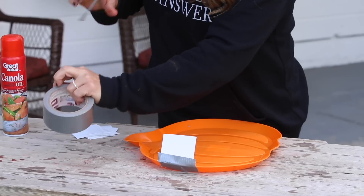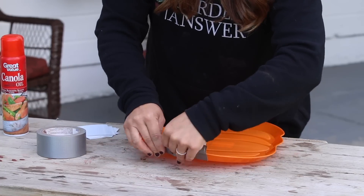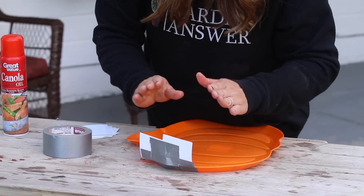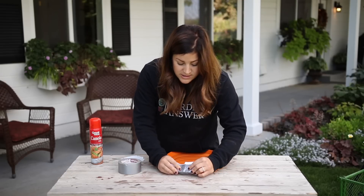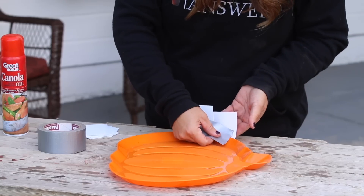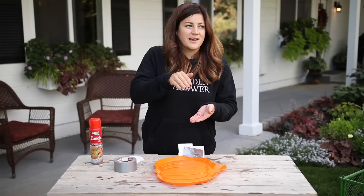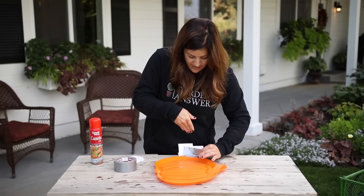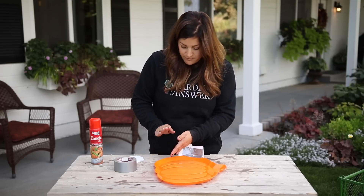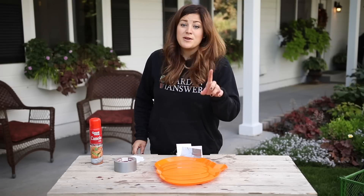It doesn't look very pretty for a little while, but it worked out well in the end. You want to make sure that you've got them really secure to each other so that the concrete, once it gets in there, doesn't push it all out. That's essentially what you do all the way around. Then when you get the whole outer part done, you want to go to the inside and tape the paper to the form so you don't have any concrete going underneath the paper and underneath the form — you want it all to be one slick surface. I did try to do it just with duct tape, folding it over on itself, but it wasn't strong enough and it didn't give me straight enough sides. So I think the paper worked a little bit better.